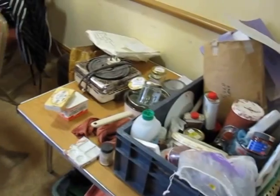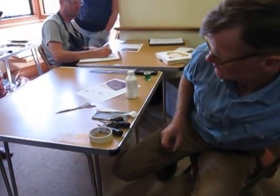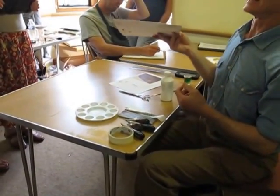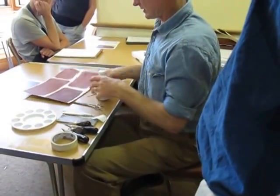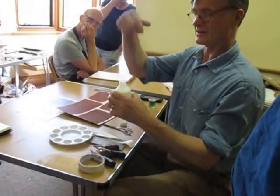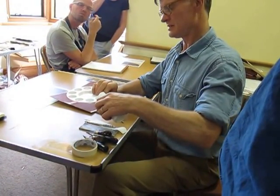So, could you bring your bit of red over? I'll just demonstrate. Now, acrylic gold size sets very quickly, and it can ruin your brush. So, a wonderful trick of the trade. Thank you. I want you all to get a bit of red ochre or something, get some card, not paper, and just paint like that, and do these exercises here. So, the first thing is decant a bit. You want a lot of control about where you put your brush. Otherwise, you won't know how far the brush is, and you'll wreck your brush and have too much size on.